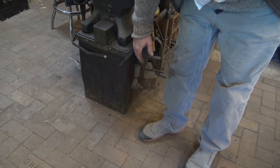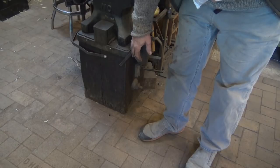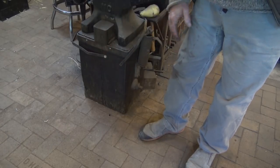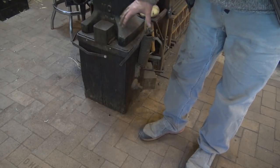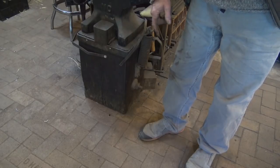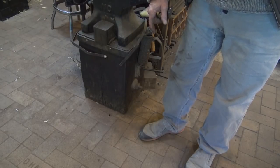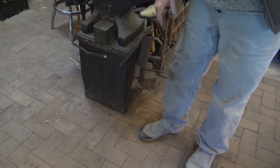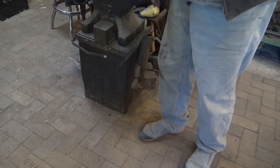Some of these metal stands people use are really quite bouncy and rattly, and they don't offer very good support. This big timber isn't too bad, but if this was my main anvil — the one I used every day — I would put a bigger timber, and it would be set three feet deep in the floor if I could, or bolted to a concrete section if I can't set it in. So if you have a concrete floor, you can bolt your anvil down, and that's another advantage to concrete.